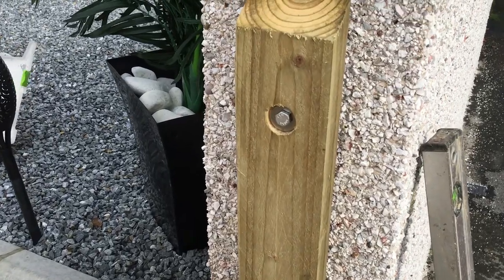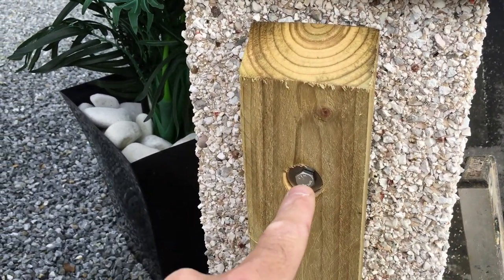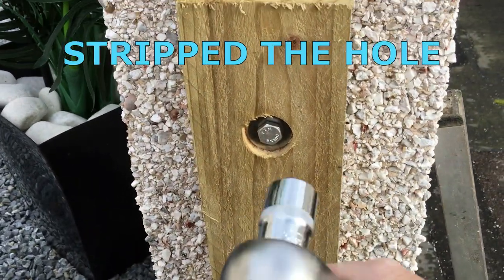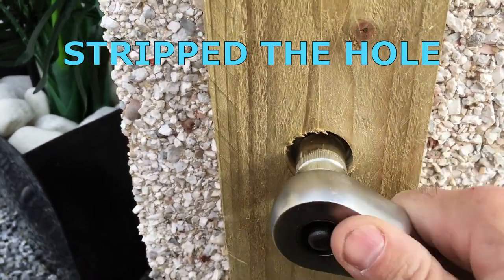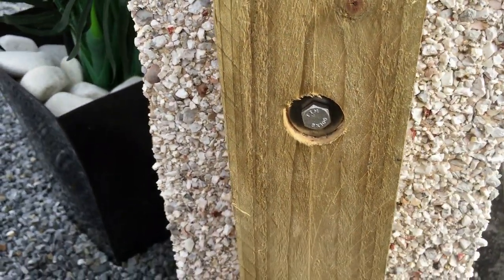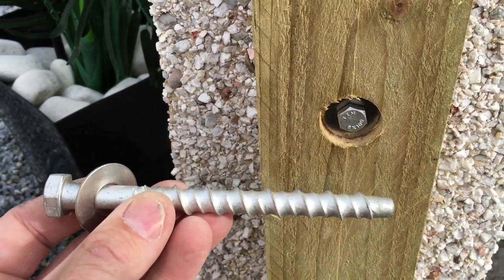Right, a quick tip I'll give you here, this is what's happened to me. This is a new wall, so this is obviously breeze blocks, the Thermalite, and it's quite soft material. So what's happened here is I've put an 8mm multi-fix fixing in. Tightened it carefully with the ratchet and it just keeps spinning, it's not tightening up anymore. So what I'm going to do, I do this all the time, so I'm always prepared. I carry a stock of 10mm bolts with me as well.